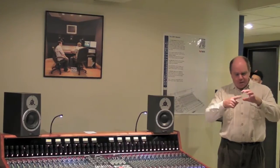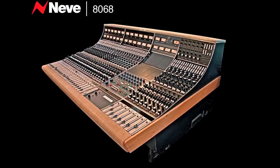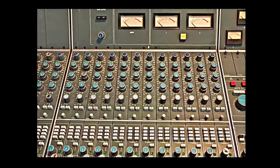That's how we're able to implement this console at a reasonable price — we've done that throughout. Some people will say it's just a relay differential switch, just a contact, but it's sonically the same. The old 1970s Neve consoles, apart from the transistorized circuitry — which is different from most modern equipment that uses operational amplifiers throughout — also differed in their mix buses. They used what's called voltage summing, where each channel feeds onto the mix bus via a mix-feed resistor.